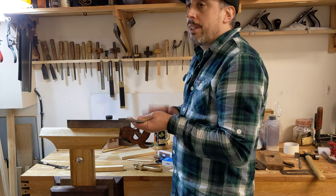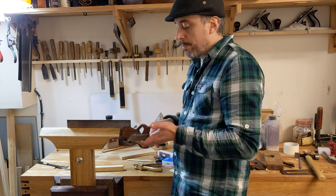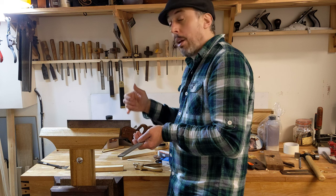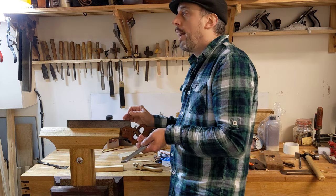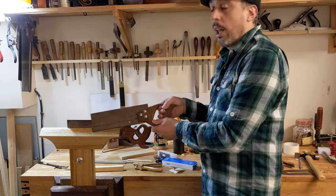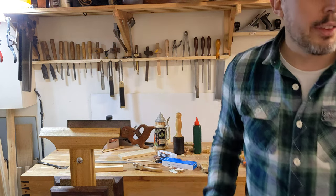You wouldn't necessarily need to do this every time. When I do the sharpening video, I'm taking a saw that's old and I've restored — I'm going to take a mill file, dress across the teeth, check where I am, and then get into the shaping of them. This saw's not in bad condition, and if you're going to learn, you wouldn't do yourself a disservice if you grabbed an old saw, did some minimal rust removal, and as long as the saw plate is not bent and it's not really snaggle-toothed, you can practice on it.